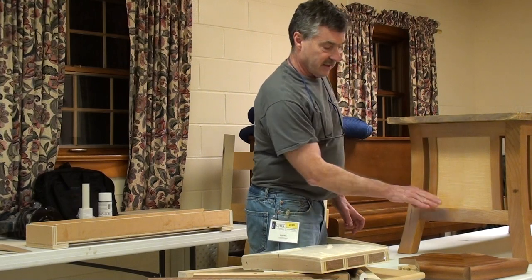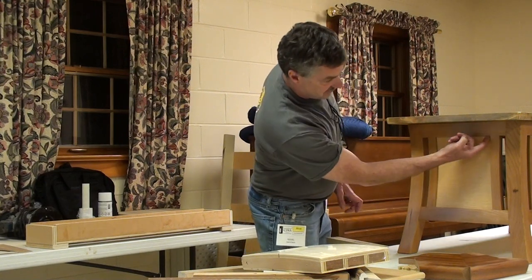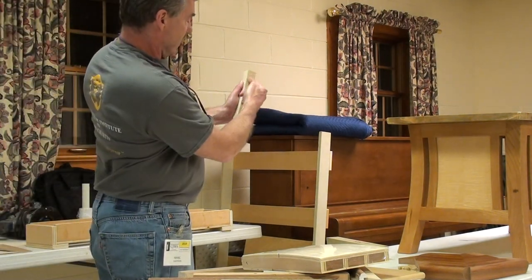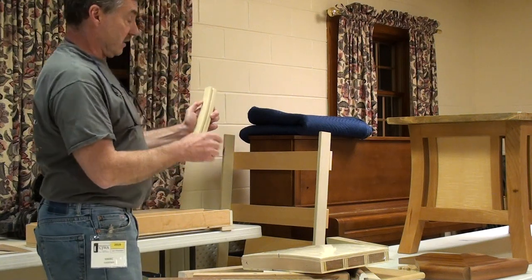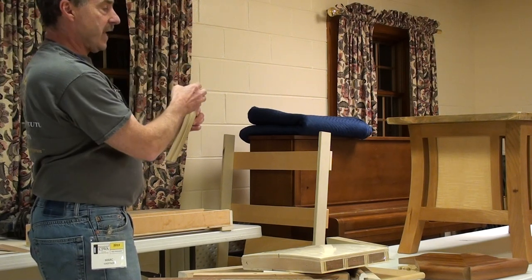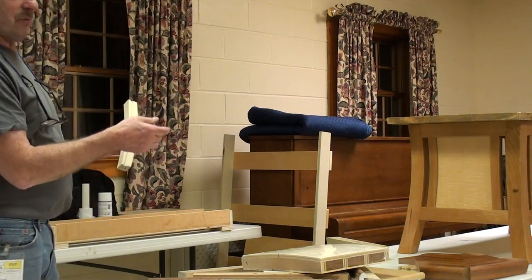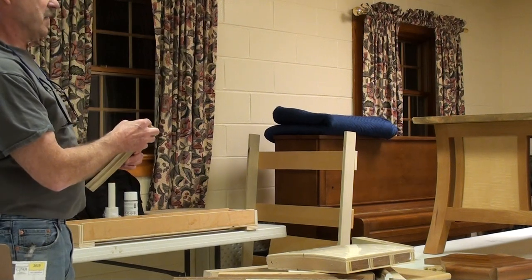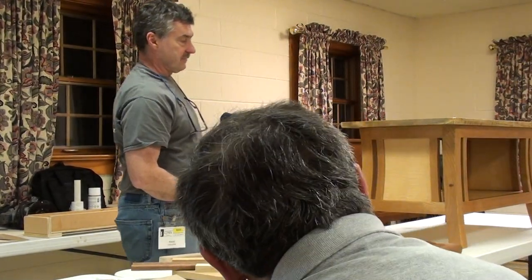The fence that sat on top had to have an angled fence on it so it would follow that profile. I laid out my layout lines and was able to do that — that was pretty straightforward. But then I had to route a slot here. I just took the router, put a radius fence on it — a longer one — and started from the top and worked my way down. I think I had to take two passes because it was just slightly bigger than the quarter-inch bit. I made up some samples and it worked good, but it's kind of nerve-wracking at that point because the more time you spend building the parts, you know it's kind of no turning back. But it actually worked out very well, and that panel fit in there real good with very little mismatch.